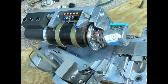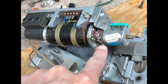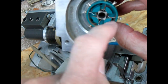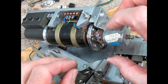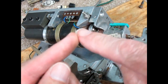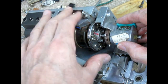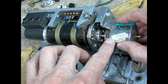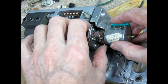There's little recesses in the end here that those Allen screws on the end of that collar are seated up in, that little recess, and so after you go so low you can't rotate it, because the head of the screw will be in the way. So back here somewhere, then you get lined up with your number 1 rotary transformer with the number 1 head, and then you seat it.